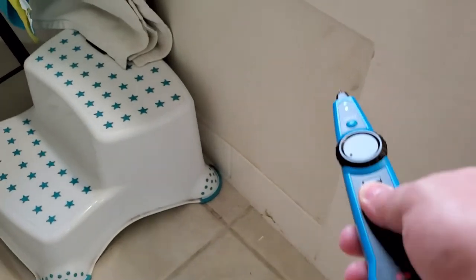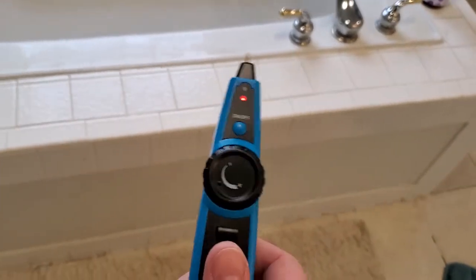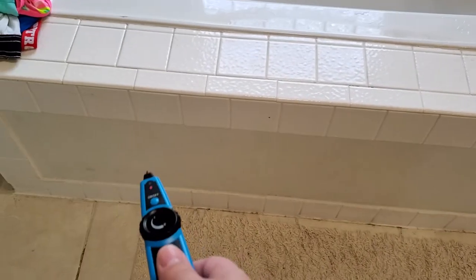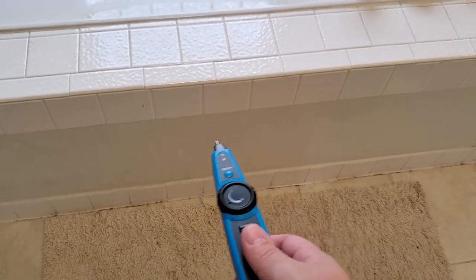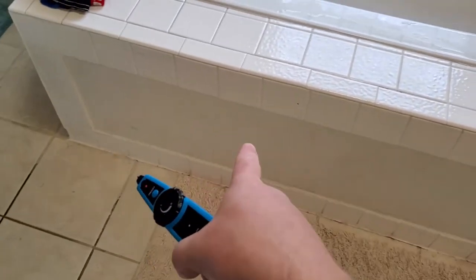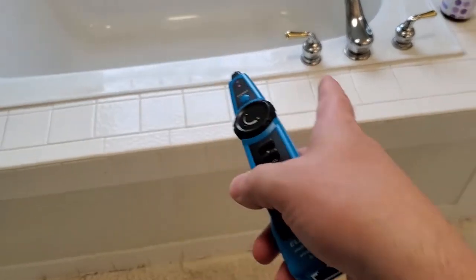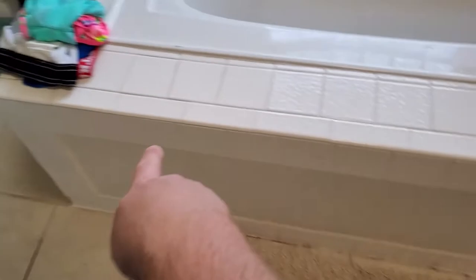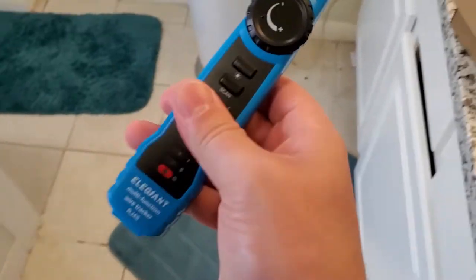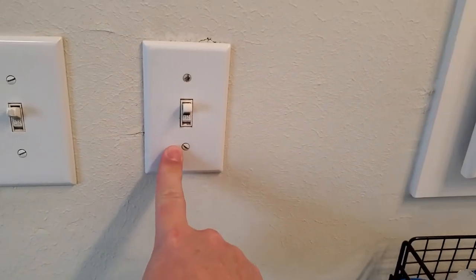I hooked it up into the circuit here and followed the signal all the way down. My jacuzzi tub is completely sealed, but I can hear the ringing right down here, specifically behind that panel. Normally jacuzzi tubs have a panel you can open up. This is also why it's applicable for medical equipment — sometimes you have blind points where you can't see, and you might not want to waste time if you don't need to. Opening this up could damage the seal and cause damage to the plumbing. Why open it if I don't need to? I had a signal down here, which means the tool was doing its job and my wiring from the switch was good.